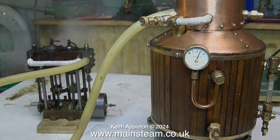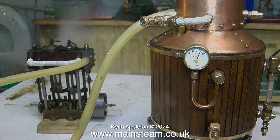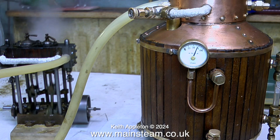On this second run of the steam engine, it's still running very well and I'm quite pleased with it. The engine seems to be quite economical as far as steam consumption is concerned. If you look at the boiler's pressure gauge, it's not making much difference to it. As this open steam launch is a sort of African Queen type model — it actually does look quite like the African Queen — it's definitely not a flash steam hydroplane. The valve on the outlet of the boiler is just cracked open, not open very much at all. I did try opening the valve slightly more to let more steam to the engine, but all that happened was the silicone rubber piping flew off the engine, and as it passed my hand it left a nice mark. So that means the steam's hot enough — it's not the best way to test it, but the steam really is very hot coming out of this boiler.